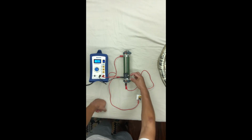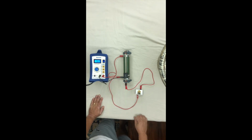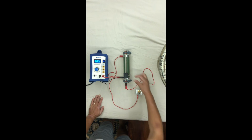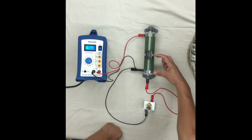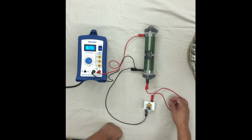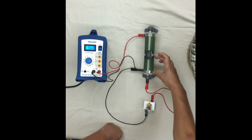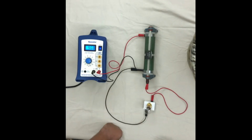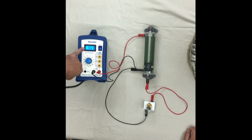Okay? But the potential difference here is low, so the potential difference across the bulb is low because the bulb is in parallel with this bit. So just to recap, the light bulb is in parallel with this section of the coil. Okay, so this is like our V2, this is our V2 output. At the moment we've only got the half resistance, so we've got half the potential difference of the VT. Okay, so down here, small resistance, small share of this.